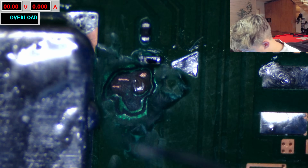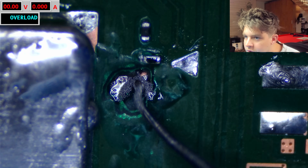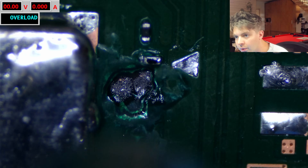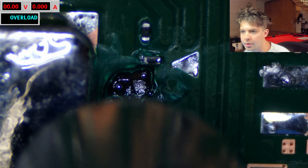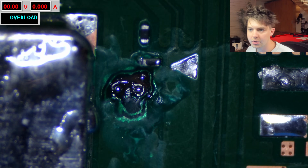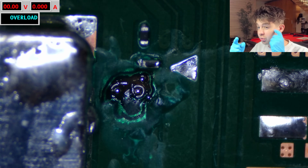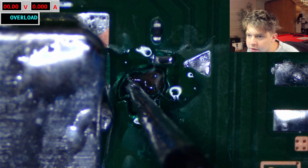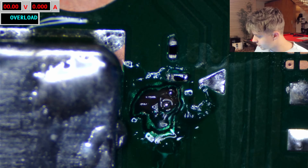Now let's get some solder into some of these areas. I'm going to dump some solder paste on my mat and pop it down in here — honestly that is probably plenty. Now we can hit this with some hot air and hopefully get some of this to stick to those pads. We got some on basically everywhere we need it. There's a little bit too much on the left — a big blob on that really tiny trace, and if we so much as hit that with our tweezers it's going to rip out of the substrate. Adding a little more flux so it doesn't stick to the pad, then we can clean this up with a Q-tip and start running some wires.